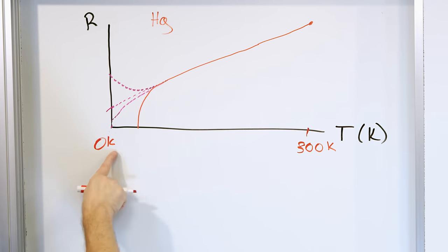And then you press them into a pellet, literally into a puck. You do that in a vise and you apply pressure. You take that puck and you put it inside of a glass or a quartz tube, which is sealed, and you put that inside of an oven or a furnace, and you bake it. So it's like an easy bake oven.